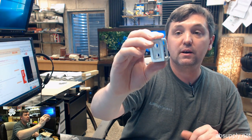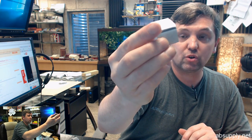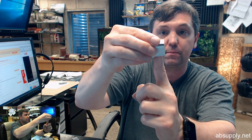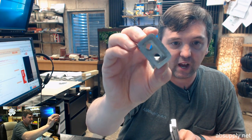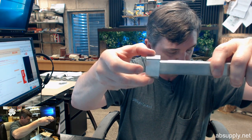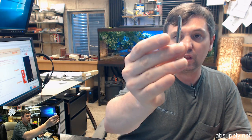You will also get the strike. The strike can act as a surface strike and as a mortise or a rim-mounted strike as well. So you can enter the bolt this way, or you can enter the bolt this way. However you're going to install it, surface mount or rim mounted, or up into the header if you've got an outswinging door. Interior doors, in-swinging doors, you'll obviously approach it. You've got your holes in the backside, so either like this or possibly like this. You will get then this would be called a mortise strike. Very large piece of strike material.